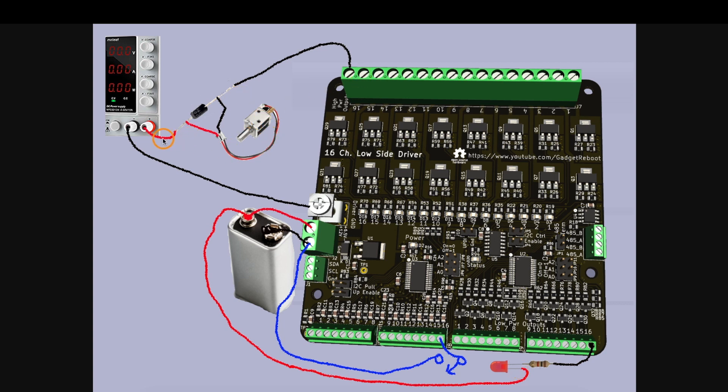With the solenoid, one side is connected to a positive 24 volt supply, and the other solenoid wire goes to the screw terminal, so when the transistor comes on it connects this end of the solenoid to ground. Being an inductive load, there should be a diode connected across the coil with the cathode at the positive supply rail, to suppress voltage spikes from back EMF when the solenoid is turned off and the magnetic field collapses, generating a high voltage back toward the driver.